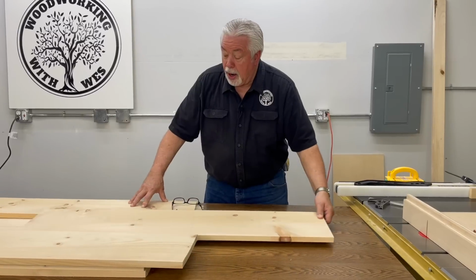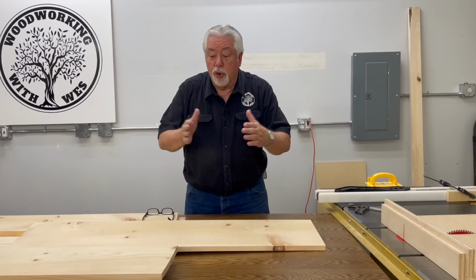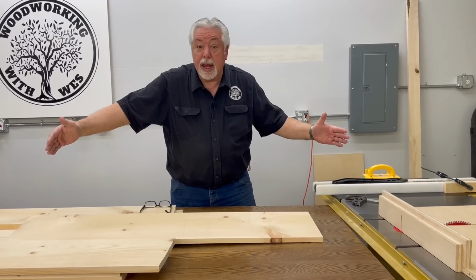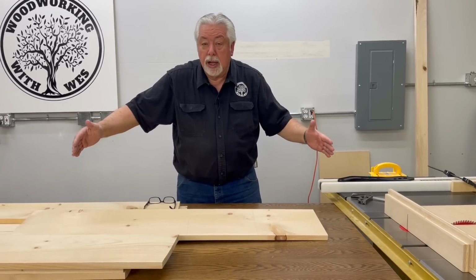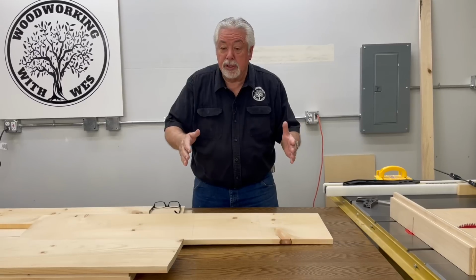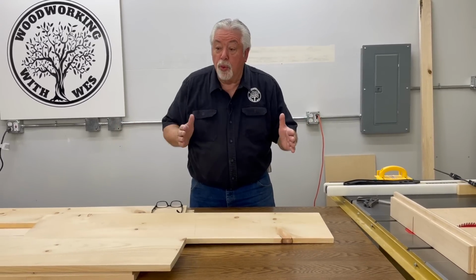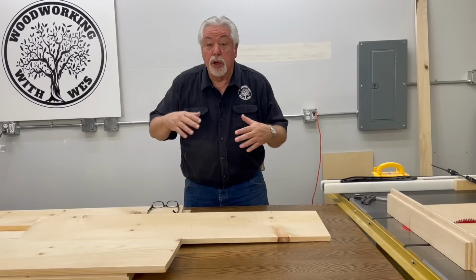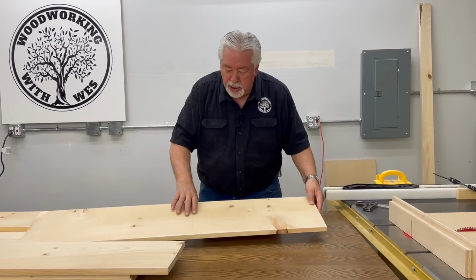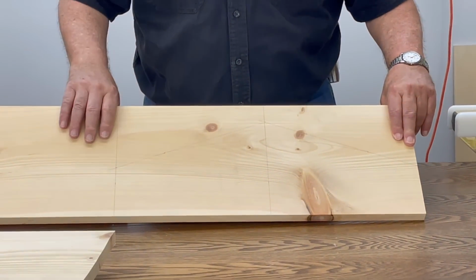Now, our top portion of our sawhorse is going to be 22 inches wide, and it's going to be 48 3/4 inches long. The first thing that we have to do to start to create that piece is to do the end pieces, and there are 2 ribs in the middle of it that are going to be support for the round top. I drew out what those pieces are going to look like, and those are the first pieces that we're going to cut.